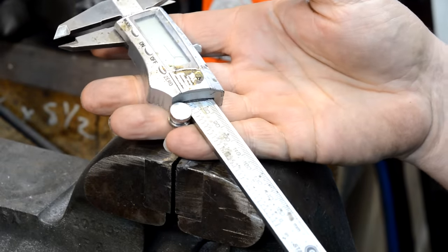You're cutting on the push stroke only, you're not pulling back - so this is the pressure profile. This corner right in here when we're all done, I want that to be round - you see how the pencil's round? I want there to be a round transition because I don't want there to be a stress crack in there. I'm not going to run this up in there tight. When we push this edge back, wherever this winds up being, there'll be a round transition up and a round transition out so we don't have a stress riser there - because that's where stuff cracks.